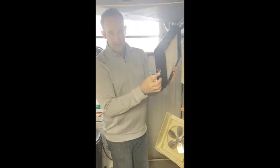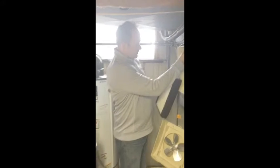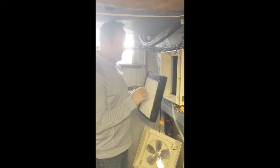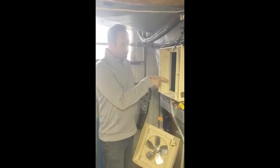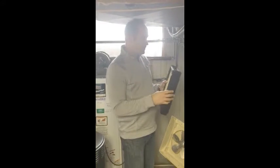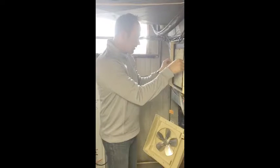The drain tube is on the bottom in case any excess water comes through. The water inlet is up here, so water comes through this system, runs from your water lines, sprays down through multiple holes, runs through your filter, and any excess that's not sucked into the furnace is drained out through the drain tube. The filter is necessary because without it, spraying water directly into the furnace would cause rust and clogged drain lines.